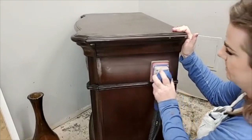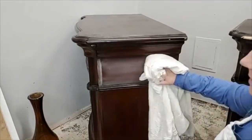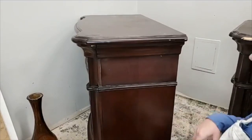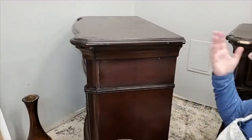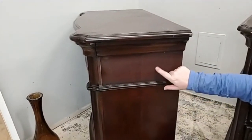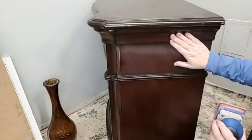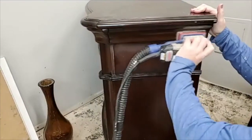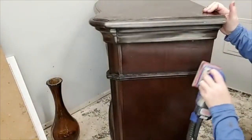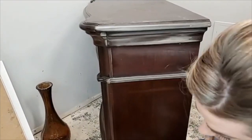I don't have my vacuum turned on so it's going to be loud — we're gonna get dust, that's all scuff sanding is. After sanding, I'll dust the piece and tack the dust off. I prefer to clean before I sand and then come back and rinse the dust away. You can see the difference between the top and the bottom — I've scuffed it and it turned a little bit white. I didn't take it down to bare wood, I'm just taking the gloss down.